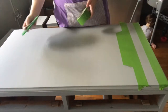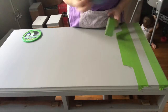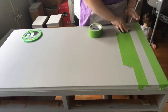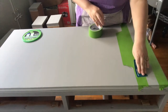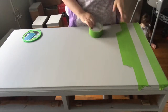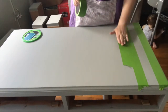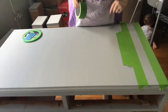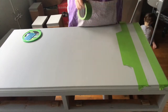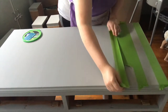Very, very easy process — you can add stripes to just about anything. I've got myself just a credit card, whatever you've got hanging around, and I'll use this to smooth down the edges of my tape. All that is doing is making sure those edges are sealed nice and tightly so that we don't have any bleed through underneath. I also have a piece of smaller tape here that doesn't go all the way to the ends — this piece is my guide. I'll move it each time I've finished a stripe, and all this is doing is making sure that my spacing in between each stripe is exactly the same.